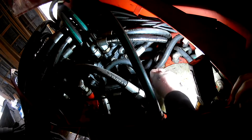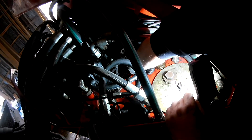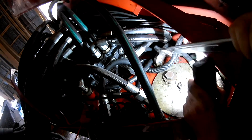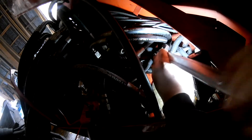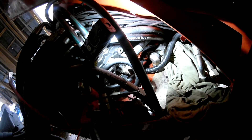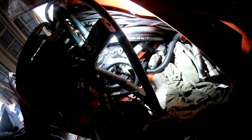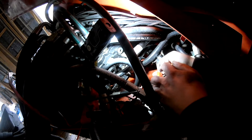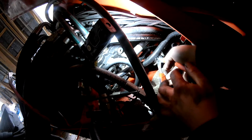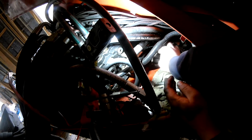I suspect there is a minor leak down at this elbow connected to the tank. Since we'd had the machine running, we had seen that leak. I hate those kinds of elbows where there is a washer and a seal underneath — they don't seem to be easy to get a good seal on. The unit was removed and there were signs that some thread sealant had been on there at some point. It was a really tight squeeze getting it out, but eventually we got it out.